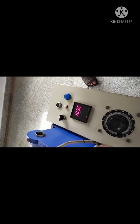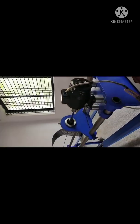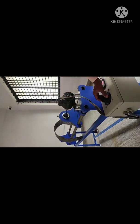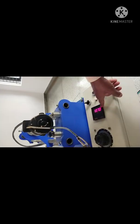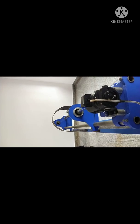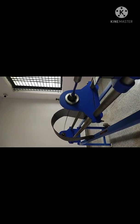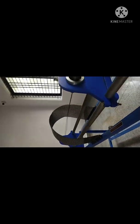The shaft speed is 1035. Single mode is coming at 1038 RPM. Then increase the speed so that we can see the double mode. Now it is single mode only. Actual speed is 1375 — single mode. I think you can observe clearly. Yes, increase it — increase the speed.